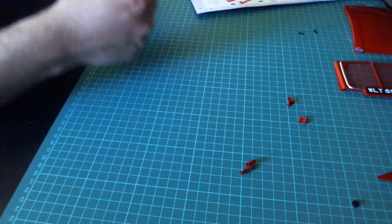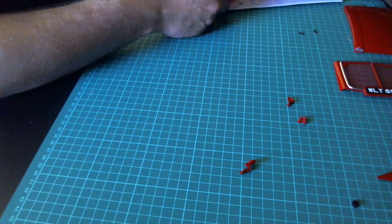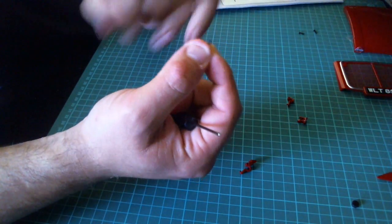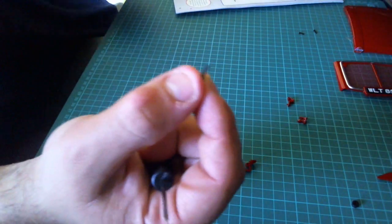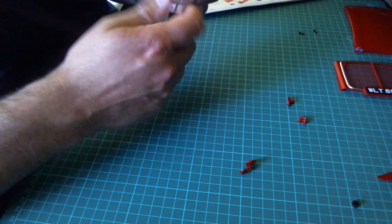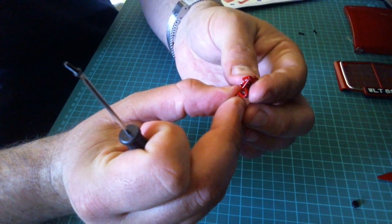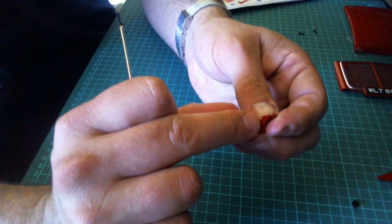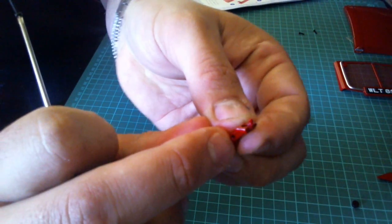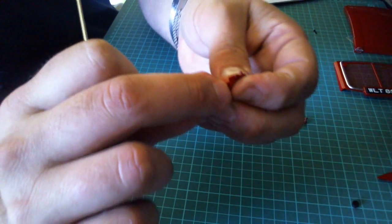Okay, so the AM screws we used earlier are 3mm, and then the BM screws, these ones, I thought it was really long. I wanted to find out the measurements, but these are 7mm, these ones. Okay, so once we've got this lined up, it wants this screw to go through on the opposite side of the locating pin. So you've got the locating pin on this side, the screw is going to be driven through this hole here from the opposite side.